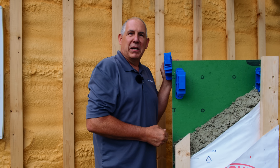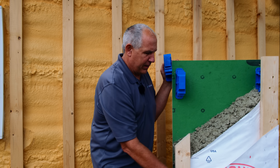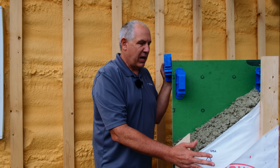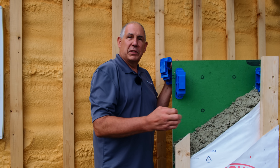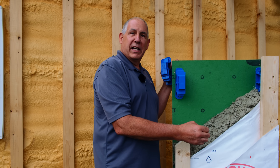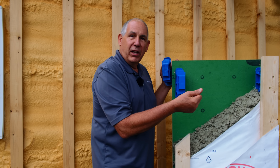This is what carries all your load — it's not just a structural screw going through eight inches of insulation hoping that you hit the framing stud behind there. You'll notice a little bit more redundancy built in here. There's another layer of house wrap on here. So for those of you that like the building science, you have the cladding going on here and it's fully ventilated on the backside, so quick, easy drying. It's going to last a lot longer; your paint's going to last longer. You've got the ventilated rain screen in here, so it's pressure equalizing. On a windy day you don't get water trying to get sucked in — it just drains down. It's like having a double umbrella on here.